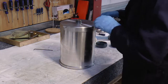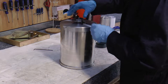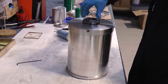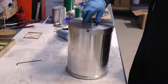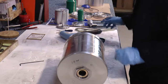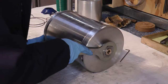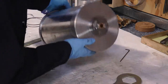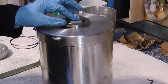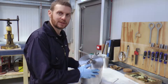The final stage of bowl reassembly is to replace the washer and the top cover nut, turning anti-clockwise to tighten. Tighten up to ensure there are no leakages — take the spanners and make sure it's nice and tight. The top of the cover nut should be level with the top of the bearing tube assembly. That completes the bowl reassembly.